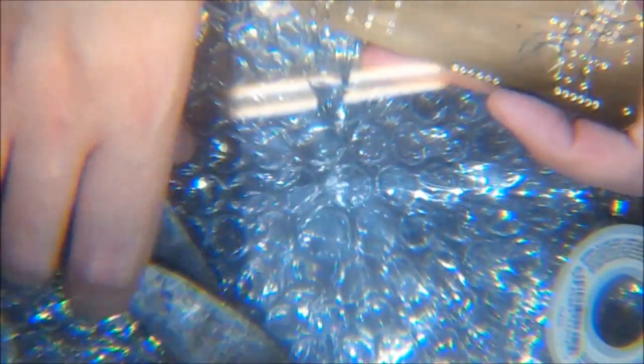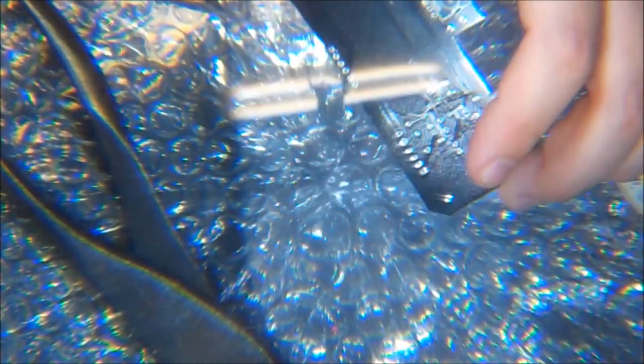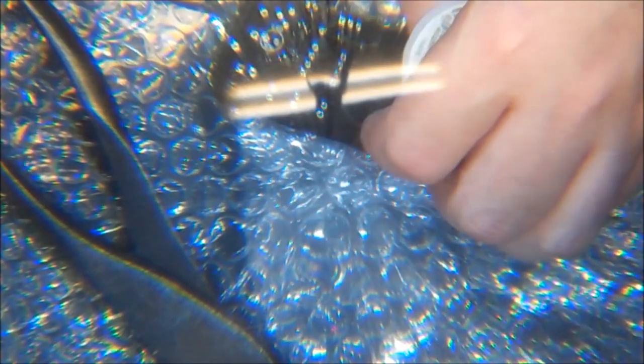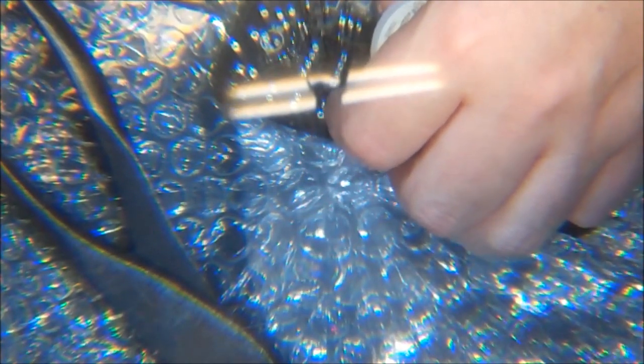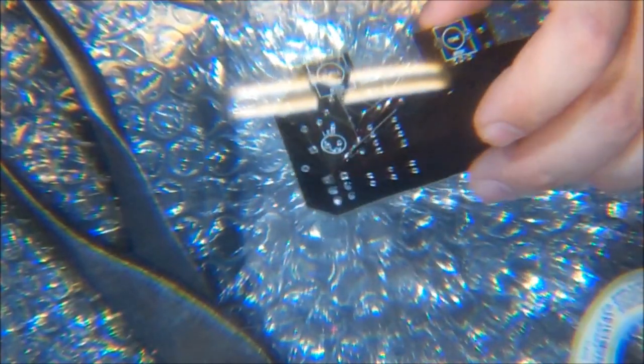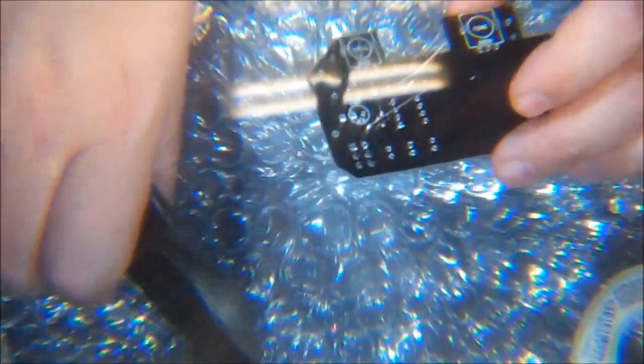And I still have one more to solder over here before I can clip that whole onslaught. There's one more in here. See, this is the fun stuff about trying to do a whole group of them at a time. Just check your work as you go and you'll be fine. So, I think that's all of them. So we'll start clipping here.